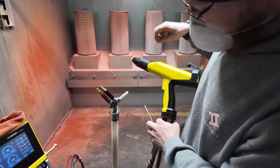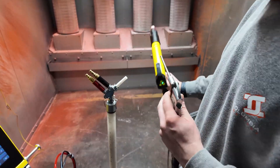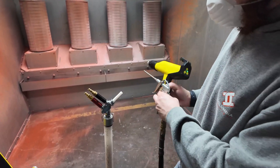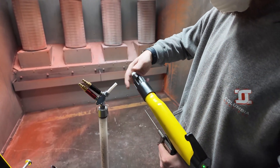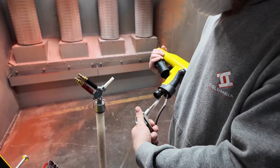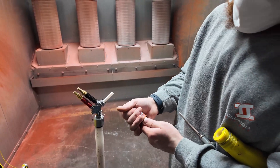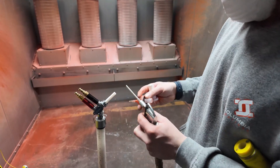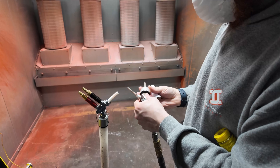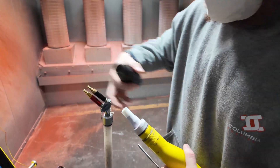Pick up the spray gun. At the bottom there's a spring collar — when you pull it back, you can remove the barb. Set it down and clean out the gun itself. Blow out both ends to get a majority of the powder out, then remove the nose cone and blow it out one more time. The spray nozzle has a protective covering shell — just remove that, blow them out, reassemble, and slide it back on. Clean out the nose and thread it back on.